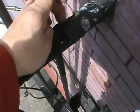Same thing here with the second platform. Missing bolts, missing nuts in some of the connections, square bolts. This fire escape probably hasn't seen work since the time it was installed. You can see the paint just peeling off the fire escape easily. And most likely and definitely this fire escape contains lead. So as I mentioned, whoever's going to touch this fire escape needs to have an EPA renovator's license.